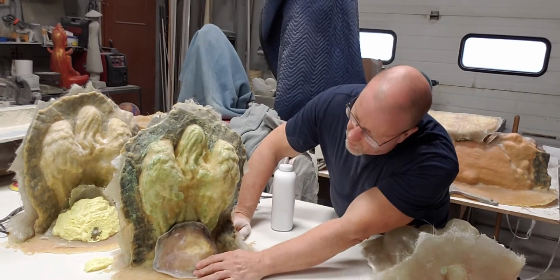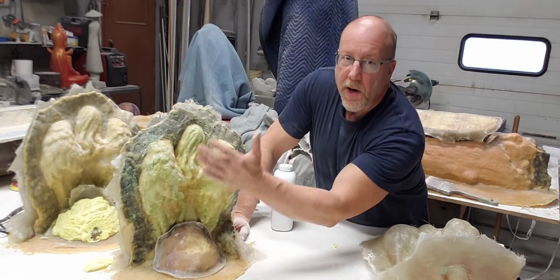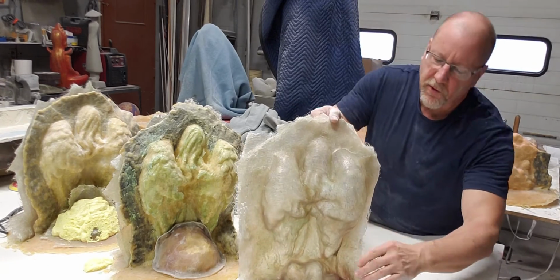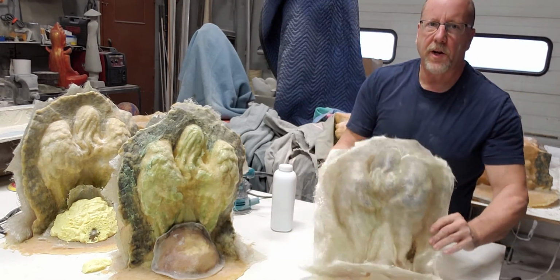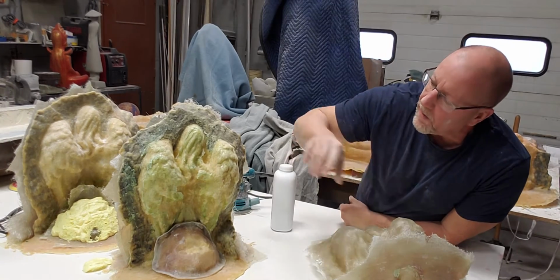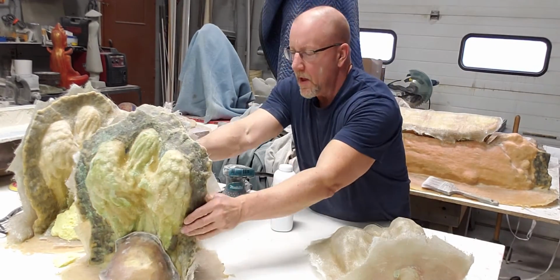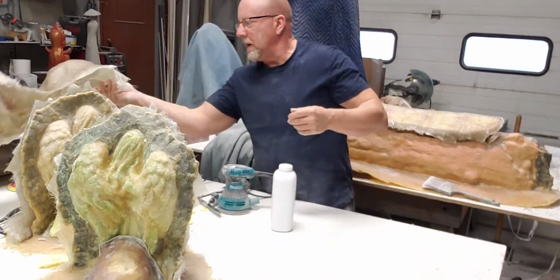So now what that allows you to do is glass one piece right over the top of that. It's going to look like this, but it's going to have a bulge to match this. So then you can just get away with a one piece. If you didn't, you'd have to do all different sections to get that to pull out of the area. So that's how you do a one piece like that. I hope that helps, gang. Give it a try.